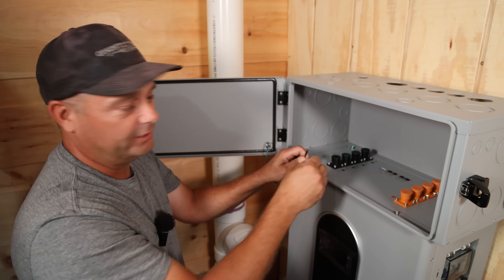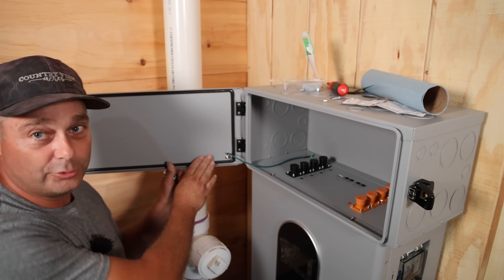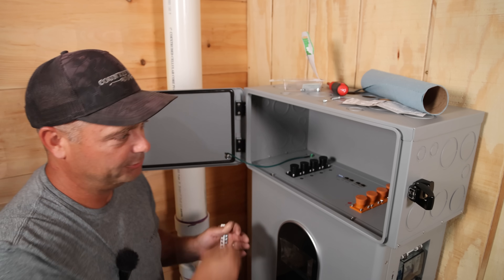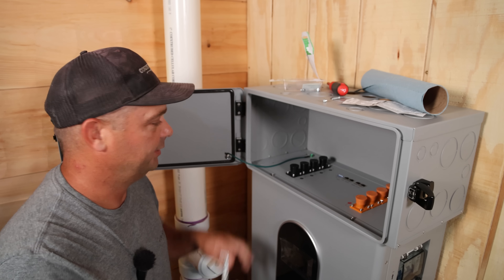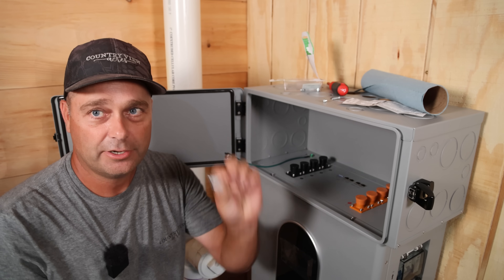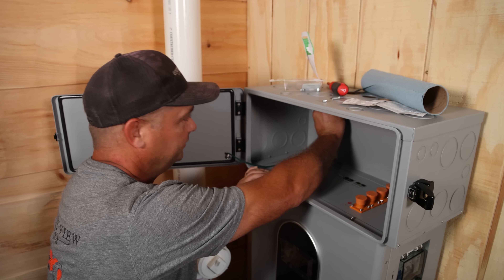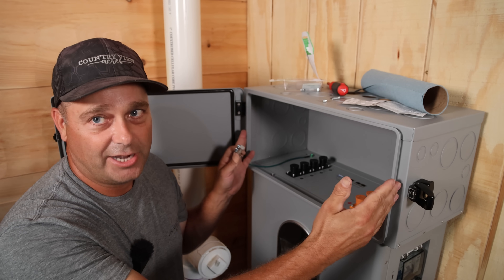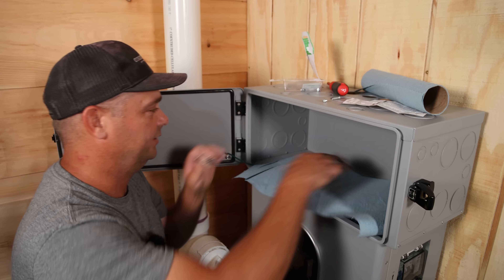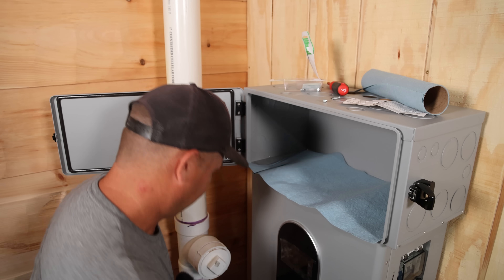We still have to ground the battery and tie it up to the ground on our inverter so it can be bonded back to true earth ground. Looking at this, the door is grounded and the top of the battery is grounded, but the case itself doesn't appear to be grounded — the hinges aren't a good bond and the screws aren't bonding it either. So better safe than sorry, I'm going to mount a ground bar to the back left side of the cabinet so the case is grounded and I have a good ground point inside.